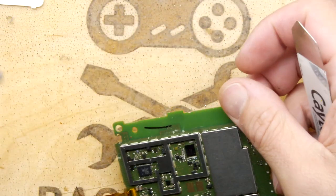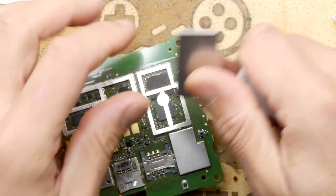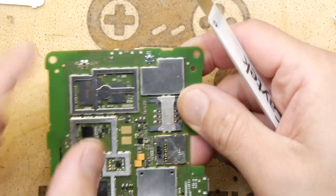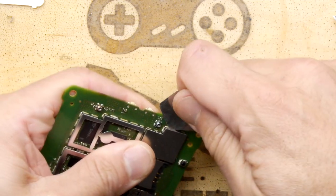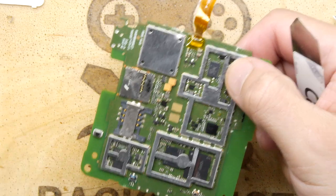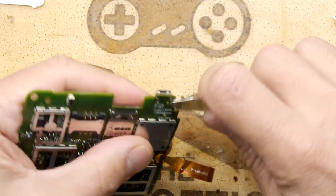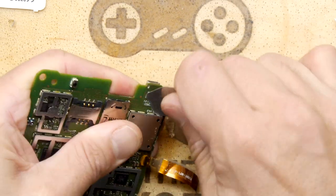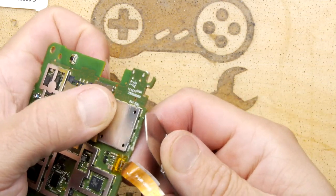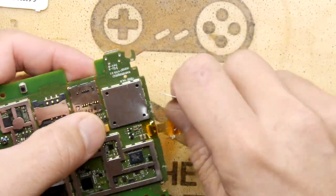There's something that's quite interesting. I found a big bag of these. So clearly in the past there was a project I'd been working on and you had to order these. So these ones obviously look quite custom because they're quite uniform shapes, but there are standard square ones, probably a bit like this one here, that you can order. As long as you can fit all of your components into that footprint, you could get your own one made, and it's just surface mount. You can just pop it on at the end after everything else. In fact, that one is soldered down.